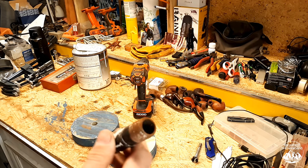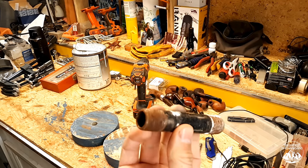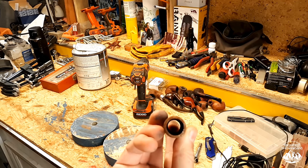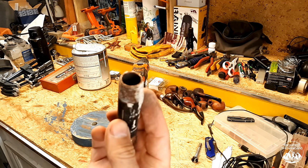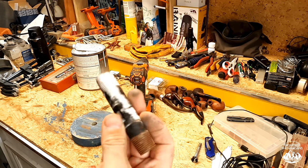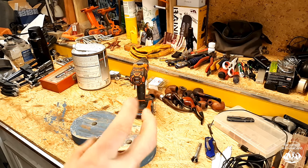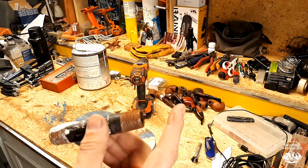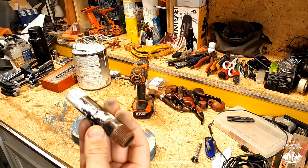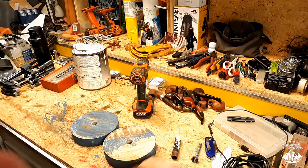And this will be perfect since I'm going to be using a carriage bolt or a regular bolt. I've got a bunch of galvanized bolts that'll fit perfectly inside here for this to ride on. It'll just help keep the wood from wearing out prematurely. And then I can cut these just a little bit wider than the quote-unquote tire is. That way the bolt will actually ride against this and not against the wood, thereby extending the life of the tire a little bit. So, all right, I'm going to go ahead.